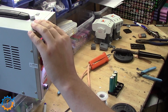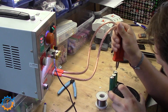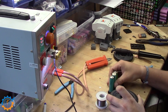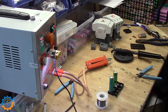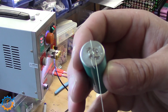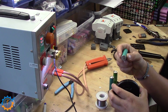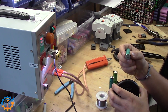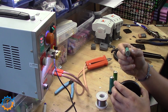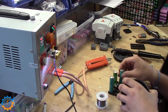But let's do another test. Let's crank up and do a spot weld where we actually weld it a little bit harder. I did crank up. So if we take a close look here, you will see that this spot weld was done with rather a lot of force. And this is where I think it can be tricky - that you use too little or too much current. And as you can see, I used too much current in this case, and the spot weld just removed itself instantly. It did not last.